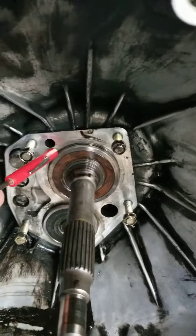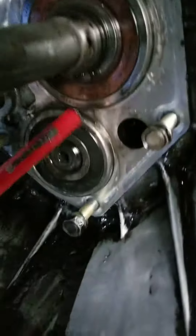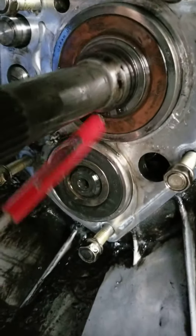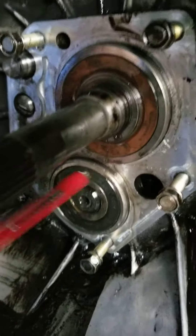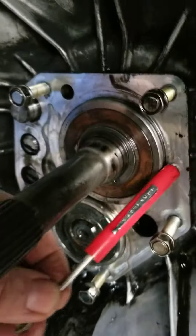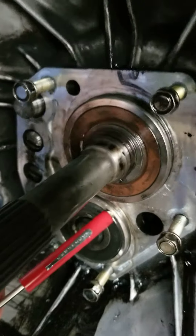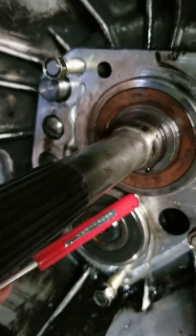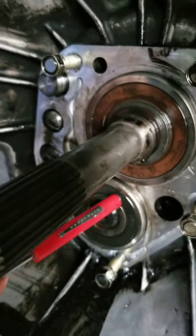Removing this snap ring is kind of tricky. Why? If you look here at the clearance within these two bearings, if you open it — try to split the snap ring, for example here — it will be bigger and it's not going to clear the bearing. So you are not able to take it out, because it's going to interfere with the bearing.